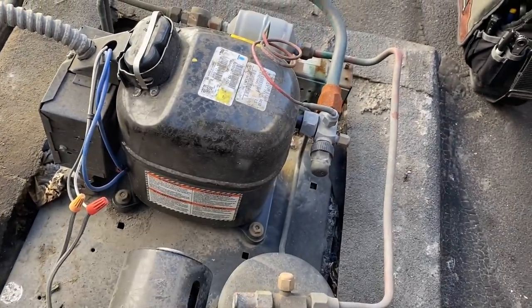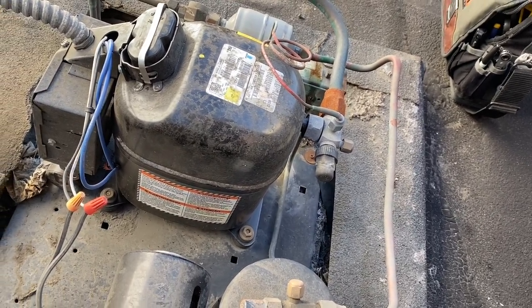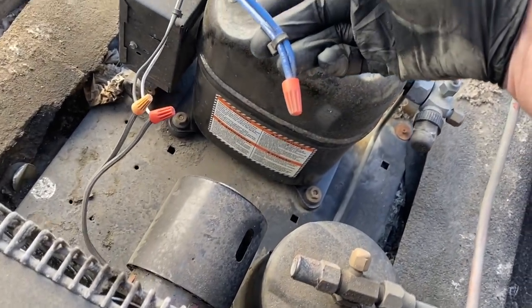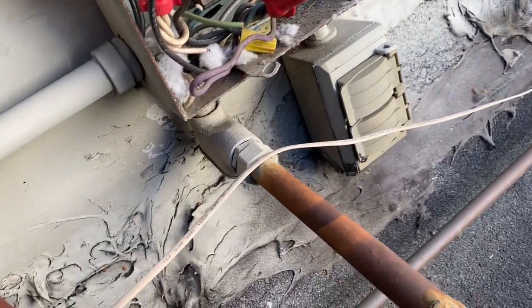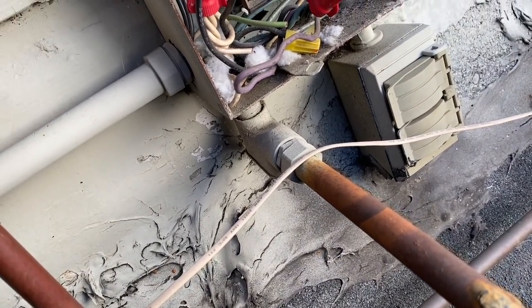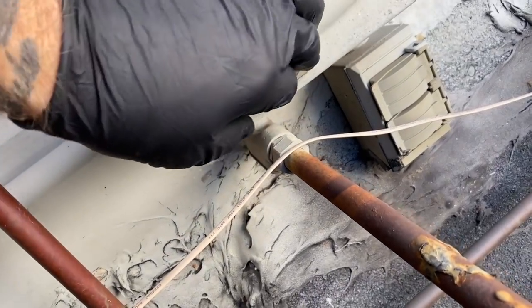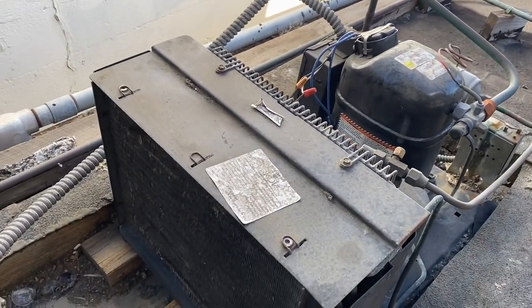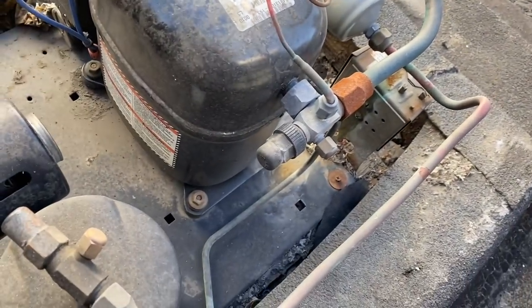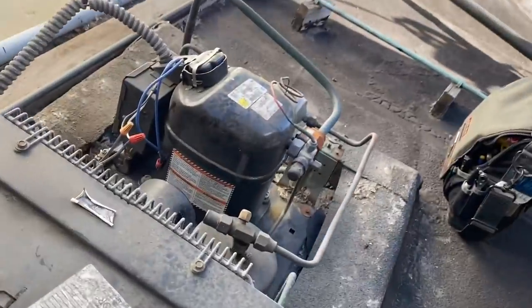This thing's iceberg cold. Yeah, there's my wires from my hi-head switch. Look at this. Compressor's dead. The condenser fan motor's a goner and the compressor's dead. They would have saved their compressor if they wouldn't have taken the switch out.